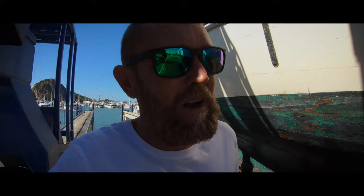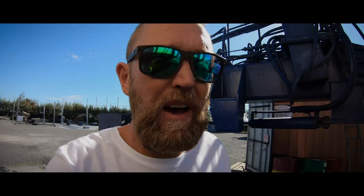So I decided to pull the boat out at the last minute. I don't really want to — I want to go sailing. But to be honest, it'll be good to anti-foul. I'm going to roll some topsides as well, put a new coat. A couple of coats on the topsides and 14 litres of anti-foul the boat takes.